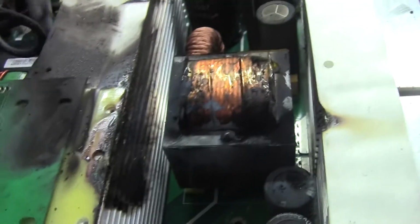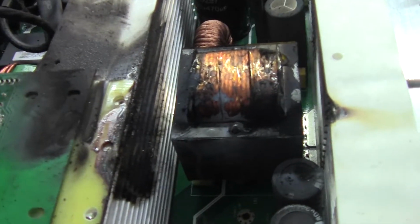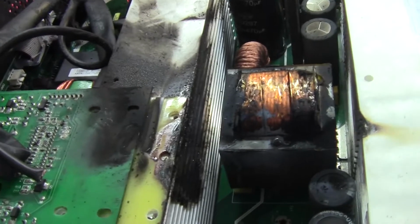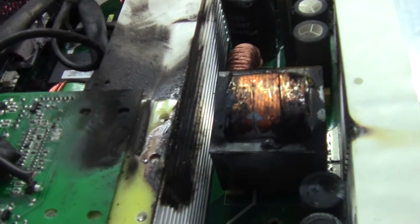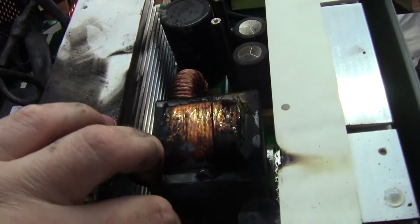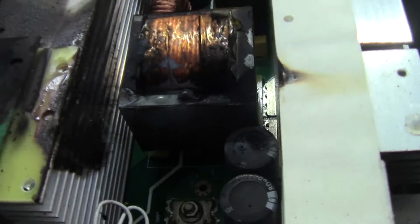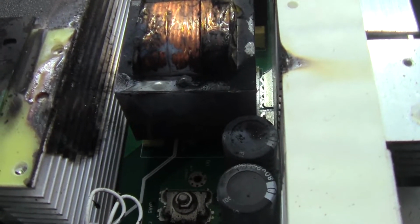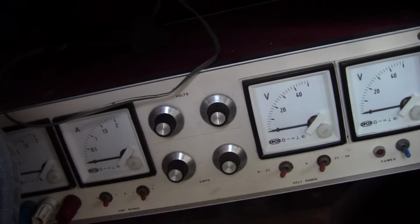Now I've unplugged this PV or the solar input. So I'm wondering, what's the safest thing to do? Hook up mains, or hook up a bench supply? I think this thing will draw too much for a bench supply. Maybe just hook up two alarm batteries or something to it. It's 48 volts, so I'll have to give it four batteries. Let me try my cheap little bench top power supply that's lying down there.